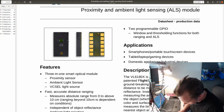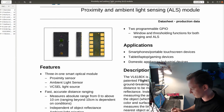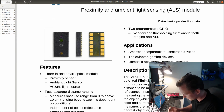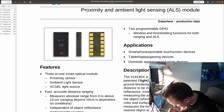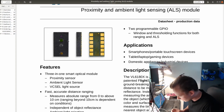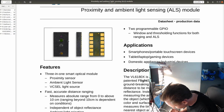And it's actually a very practical way to apply this flux, because I usually need at least quite a bit of flux so that it starts flowing around the area where I'm going to be soldering. And then I'm going to place the sensors. You will not actually see anything until I've actually placed the sensors and soldered them.